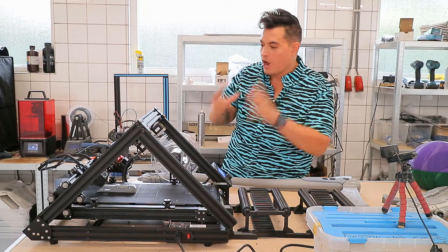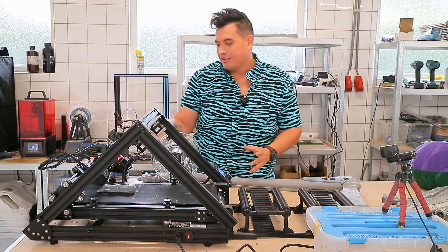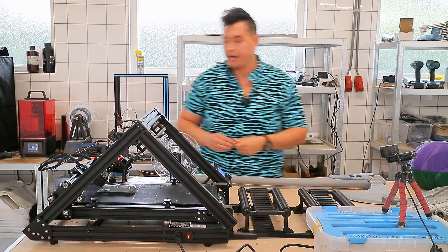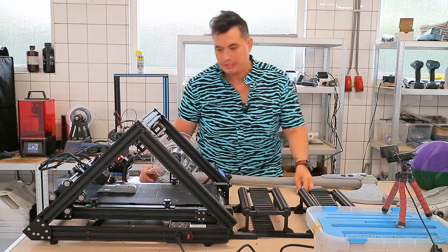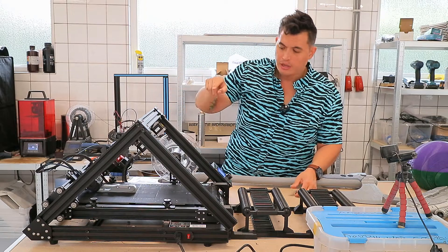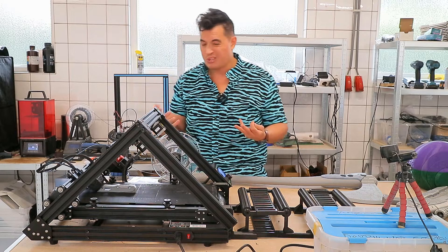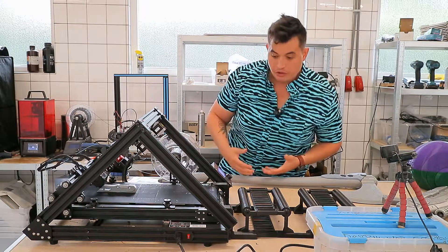That tells me the couplers are of absolutely poor quality, which is strange because the rest of the machine is built like a rock — sturdy, heavy, no jiggling whatsoever. But they added such low-quality couplers. I ended up changing mine to a better one, and I've never had any problems since. I reprinted the handle, looped a huge number of cases, and now it's busy printing the Thermal Katana from Cyberpunk. If you get this printer, change out that Bowden coupler right away.